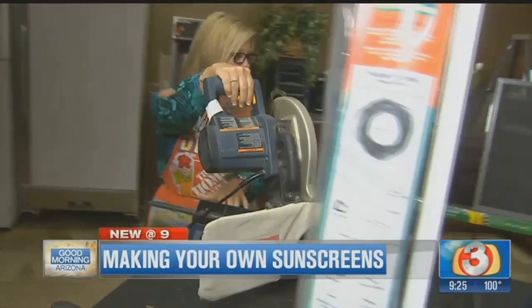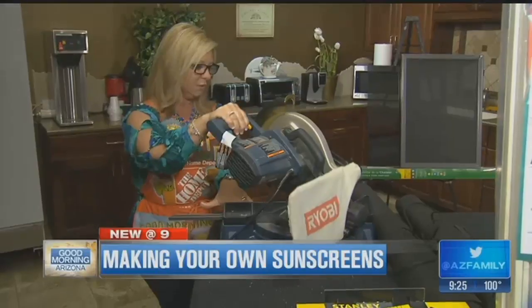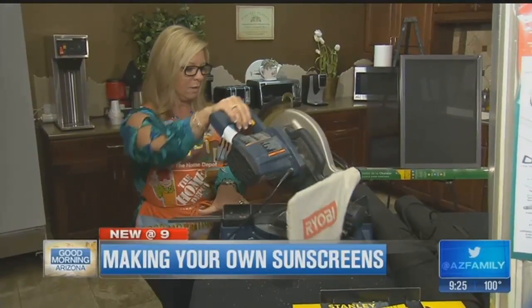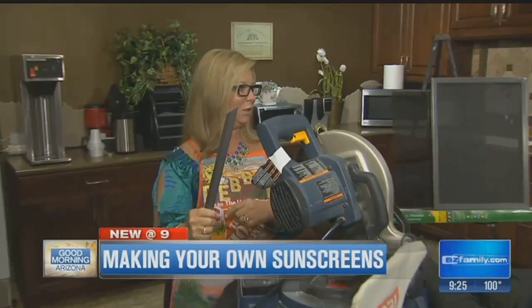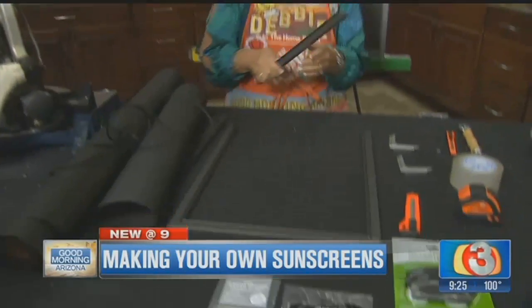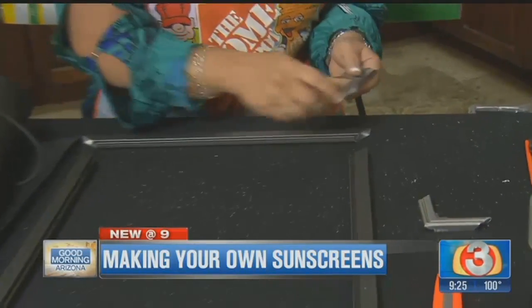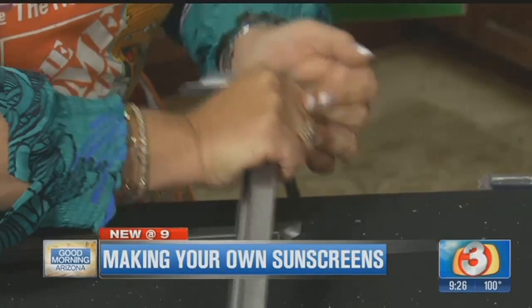Then you're just going to measure your window — measure corner to corner. And just like that, like butter, it makes a perfect miter cut. So you can use the chop saw, but again, you can use the hand miter saw if you want. Once you get everything together, you're going to put your frame together with the corners and just push them in like so.